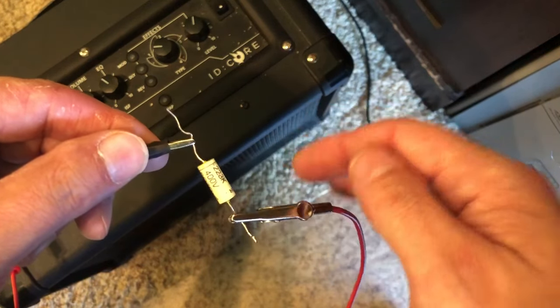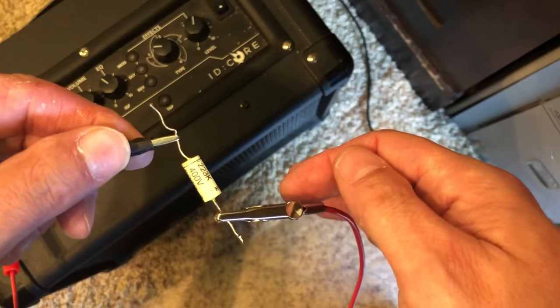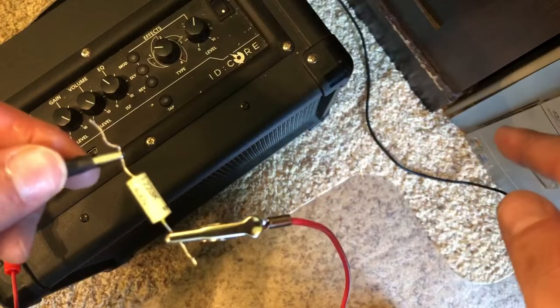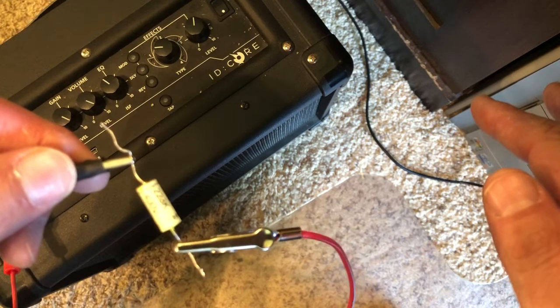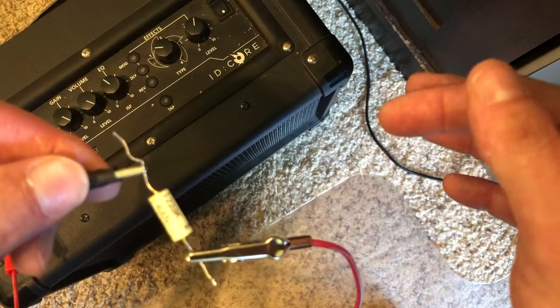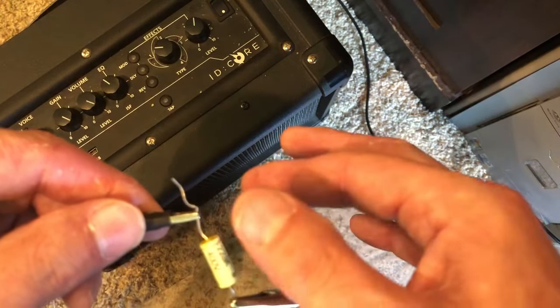Sometimes I find the bands are on the wrong end. I think that's just to satisfy quality control — they go, 'okay, the bands are on there,' and that's all they need to care about. So now you see it's much quieter, and the previous was a 0.0022 microfarad. This is 0.022 microfarad. We'll touch it — you hear it get a little bit louder.